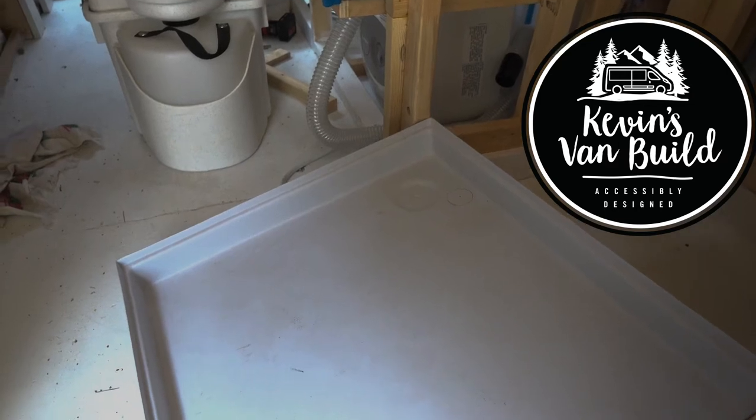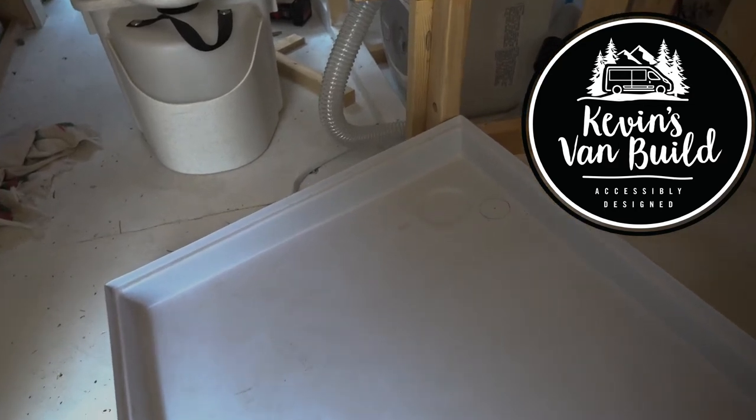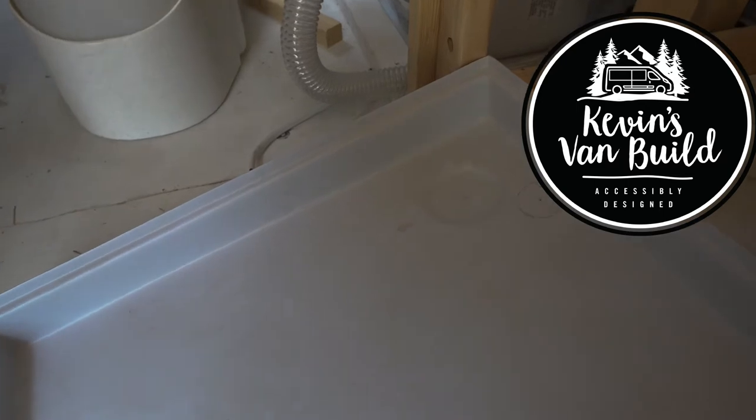Here's my shower pan, and the drain would normally go right there, but putting the drain there, it goes through the floor and hits a metal substructure, or the structure of the van, and I can't do that. So I'm going to locate it over where that little circle is, and I've been lining up everything off of a little screw, a bolt that I put through the floor of the van,